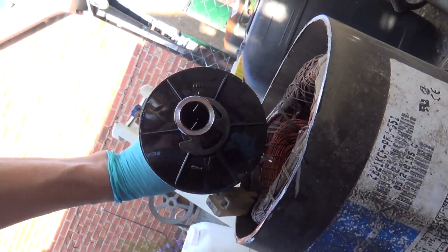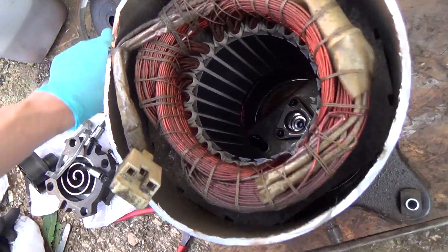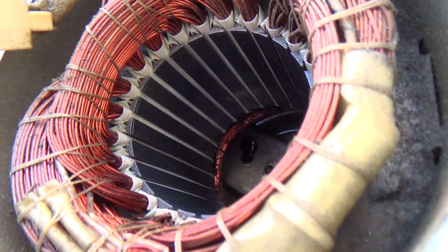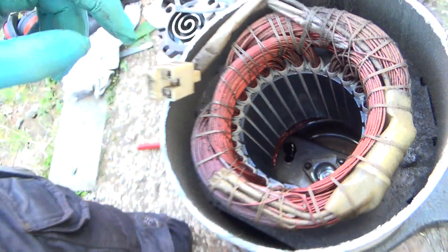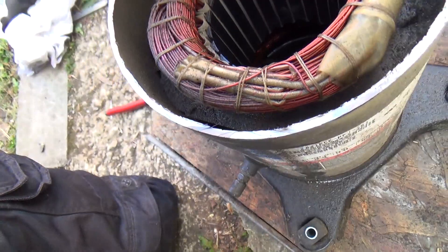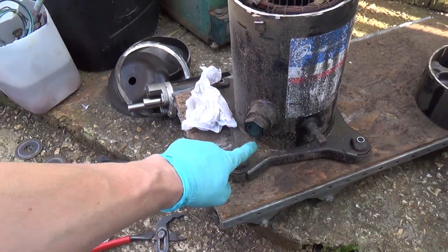That's your oil pump — that spiral. That's your little oil hole there for the top bearing. It does look like there's a molten blob of something in there down the bottom, so that might point to something having gone wrong with the windings and something dripped out of it. It doesn't look like it should be in there anyway. Let's cut round here, get the bottom piece off and have a look.